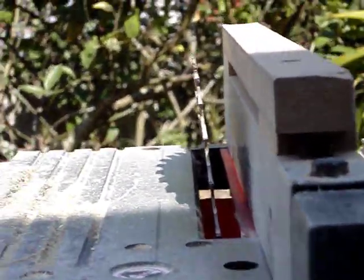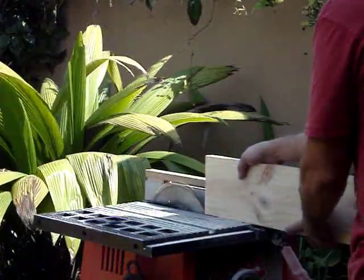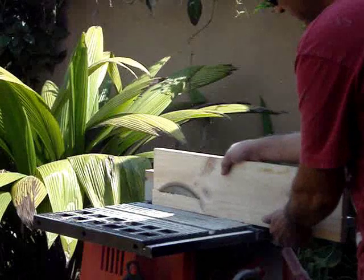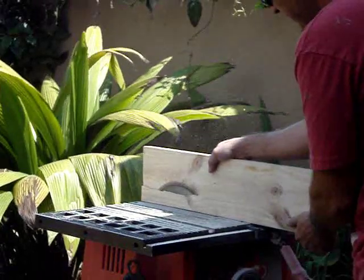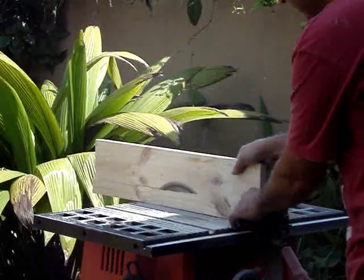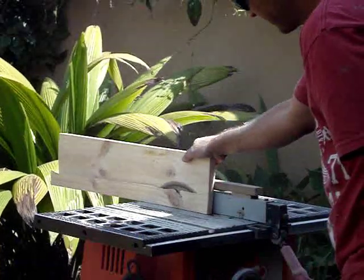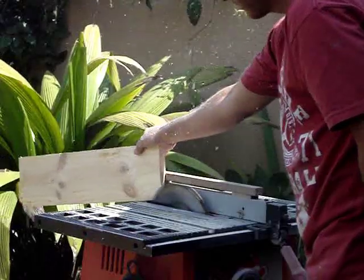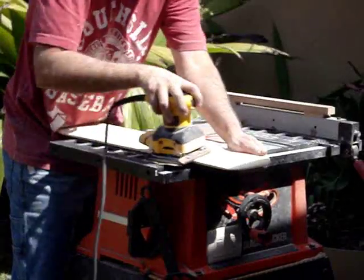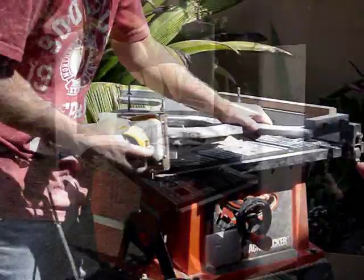This is how I made the blades - they're different from my old style. The old ones were flat, but these actually have a taper. I tapered the back about five degrees into a point, and on the front edge I trimmed off a 45 on each corner, then rounded it over with a sander. That gave me a rounded front nose and a pointed back. I sanded everything very well.